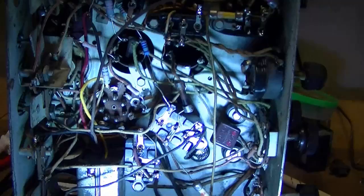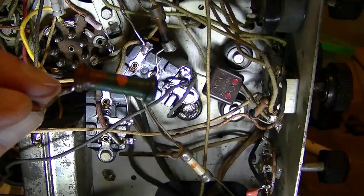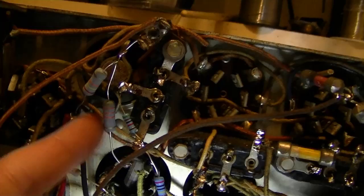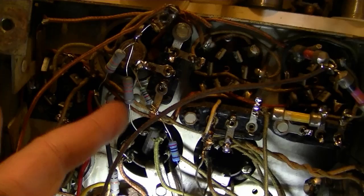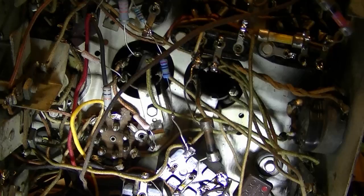You may notice I have also replaced a bunch of the resistors. It turned out that most of them that have the silver ends test pretty darn right on value. But the dog bones were all way off, so I ended up taking all of them out. Now these in general are all half watt resistors, and I could have replaced them with these little dinky half watt metal resistors. But instead, I, for the most part, went with these larger metal oxide, which are 1 or 2 watt. Not so much because I needed the extra wattage, but because the lead wire gauge is a bit beefier and a little bit longer. And although they're still blue, they're not quite as nasty looking as these guys, and it's easier to read the stripes on them. A few places I didn't have the right value, so I had to go with the smaller ones. And in a couple instances, I even went with ones that don't have any stripes on them, but oh well.